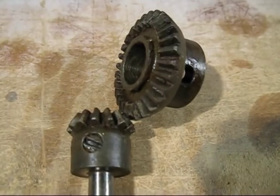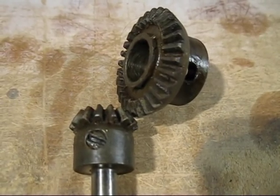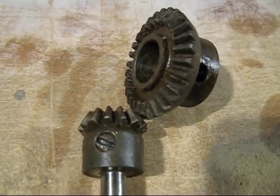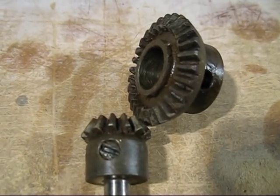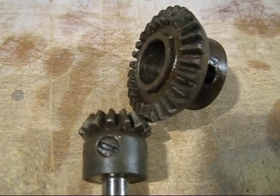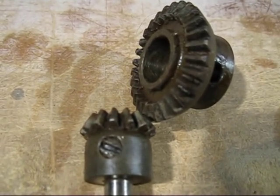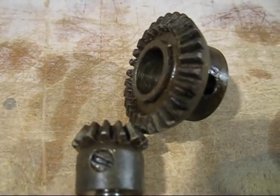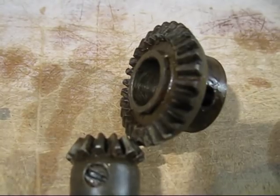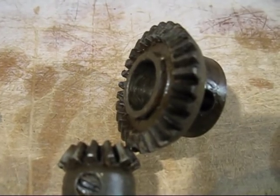Here is the prize that I'm looking at. Every sewing machine has these sorts of gears — usually right angle drive — and they are 2 to 1. I don't know why they are 2 to 1, but they are extremely useful when you want to make an internal combustion 4-stroke model engine. You have to have the camshaft running at half the engine speed, and with these bevel gears you can do that quite easily.